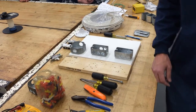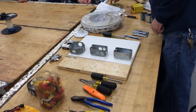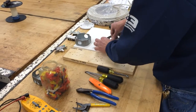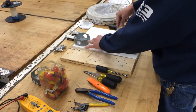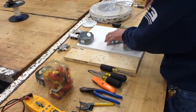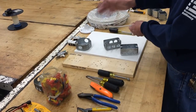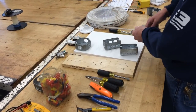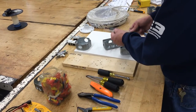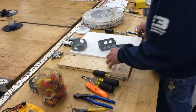I've got these Romex connectors — this is the last piece you'll need, because we cannot run wire through a hole where it might vibrate. If I just ran the wire through here without anything protecting it and it starts to vibrate, what's going to happen? It's going to start cutting into the insulation — first through the sheathing, then through the wire insulation — and if it's the hot wire it could cause a short, spark up, and hopefully trip a breaker or blow a fuse, but it could catch on fire.